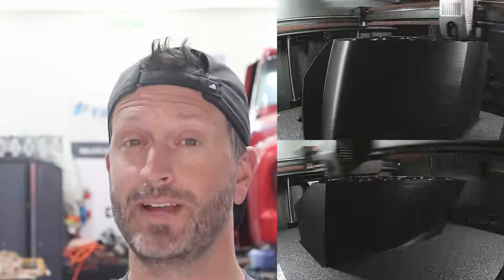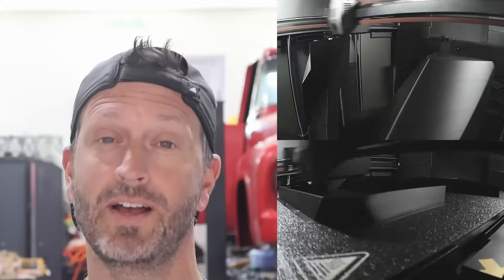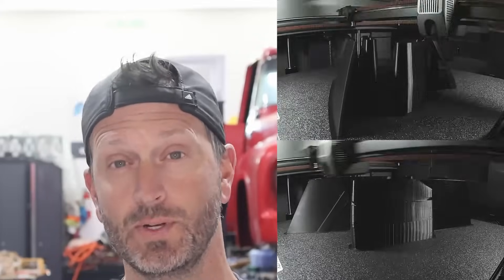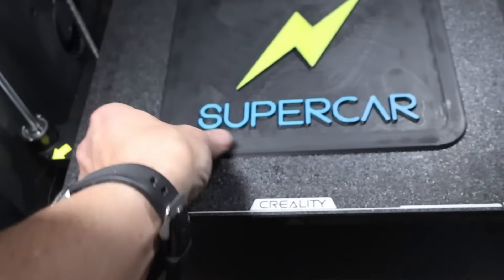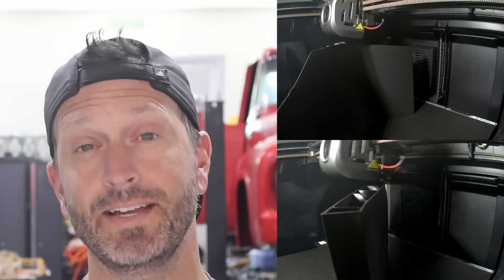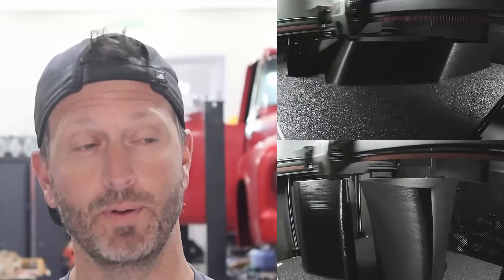The 3D printer I used most was from Creality. I've been using the K1 for a while but I recently got the K2, which comes with an automatic filament changer — awesome. When one reel runs out it can keep going without any interaction from me, and because it can hold multiple filaments it can switch between colors to make great designs. It's retracting the black — this is going to be a multi-color one. Looks like the yellow is coming out. It's amazing how quick it goes and it is fairly quiet — at 300 millimeters per second it's less than 45 decibels. Nozzle up to 350 degrees Celsius, bed up to 120 degrees Celsius, and the chamber up to 60 degrees Celsius. Most printers I've had require a lot of tweaking and fiddling just to get things to work — this one right out of the box was working and printing just great.